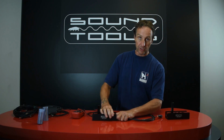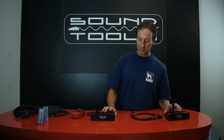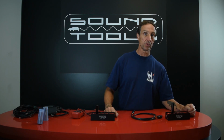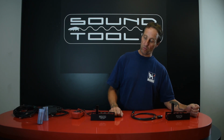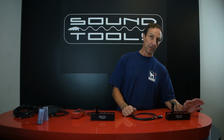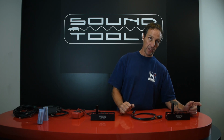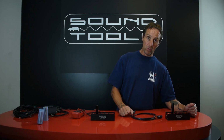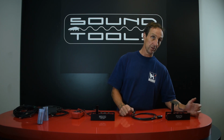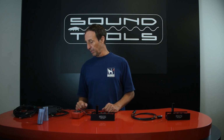All right, so the shield is critical to the operation of these boxes. Now they will work, CAT box, CAT tails, CAT rack, they will all work with unshielded cable for line level audio signals, although they will be more susceptible to hum and buzz. They will not carry phantom power. They will work for DMX. AES does not require the shield, although it's helpful in preventing it from interfering with other things.